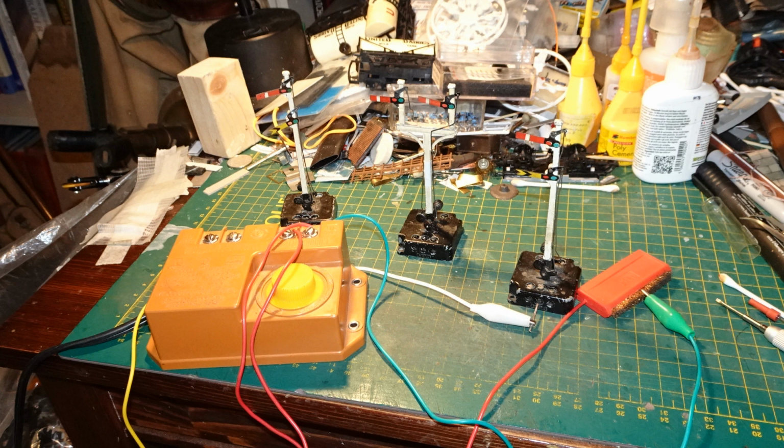The contacts are based on wires being inserted into holes on the side of the base and then held in place by screws on the top. One of the signals that I received was missing its screws, the one in the middle here. I was able to replace the screws with some from a set that I bought on Amazon to help with repairs, etc. I used M2x6 screws. The original screws wouldn't have been metric, of course, but these were close enough to work.